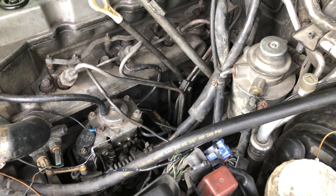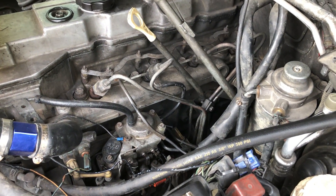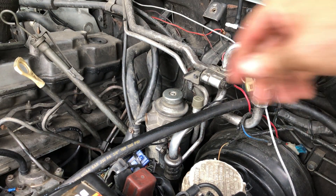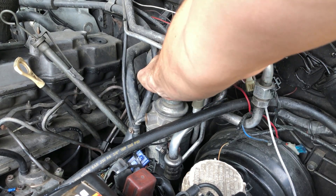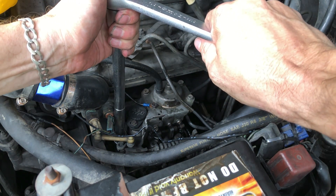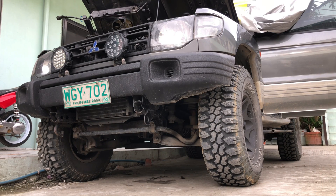Everything important is in place. I'm going to give it a test run and adjust the main fuel load screw and also the idle at the same time — hopefully it'll run enough for me to do that. It doesn't start — I'm hoping it's because the system needs to be primed. I've had to do this on the side of the road before after the fuel tank sat a few days without any pressure in the system. So from the water separator slash pump hand pump — I'm just going to crack that open and pump. Yeah, okay, fuel's getting there. Let's see if that new solenoid works.